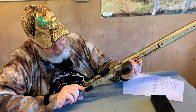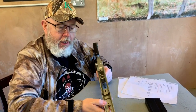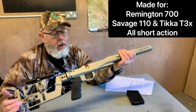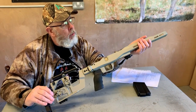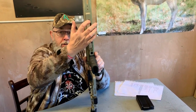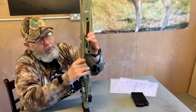It is height adjustable. The kit comes with a short section of Picatinny rail for a rear grip, though if you were going to ride a bag you'd take it off. What I really like about it is this massive barrel channel — you could probably get a 20mm cannon barrel in there if you wanted to. This is for a 700 short action. I believe Automatic also did them for Savages. The only thing I found is that when I dropped my 700 into it, everything fits perfectly, but there's a lot more meat here and the standard screw you'd fit in a normal sporting stock is too short. I had to get a full-length one and cut it down to four threads off the shank, and it's fine — it doesn't take long and it's easy to get hold of, but just bear it in mind. The rear screw I didn't have any problems with at all.